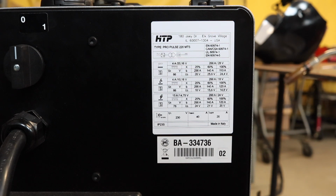The way that works is, duty cycle is measured, if it's done correctly, in a laboratory, and if there is no other numbers mentioned, and if it's done by the proper standards, it's done at 40 degrees Celsius, which is 104 degrees Fahrenheit. Inside this machine, there's a fan, and it flows air through the machine across the heat sinks and all the components that are in there. There's components in these machines that should not exceed 140 or 150 degrees Fahrenheit. Now, if you put 104 degree air inside that machine, those are the results you should be able to duplicate and to measure.